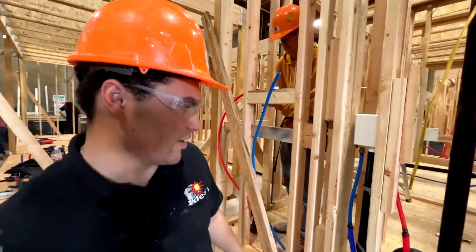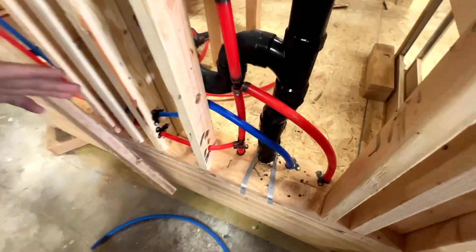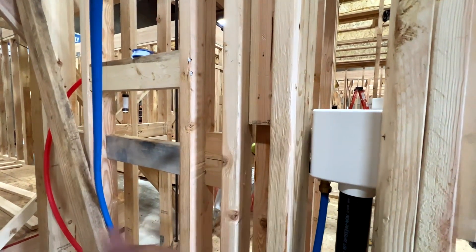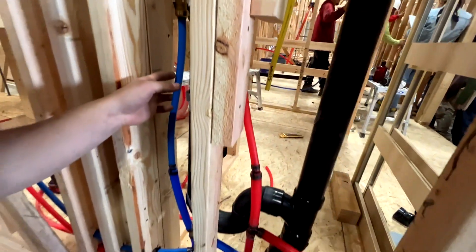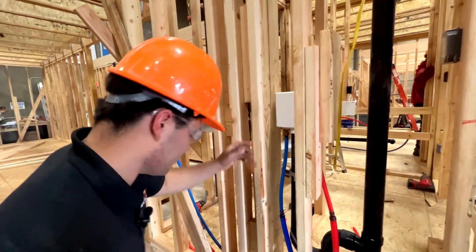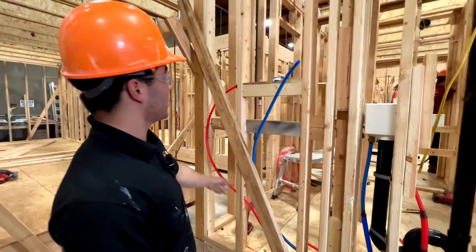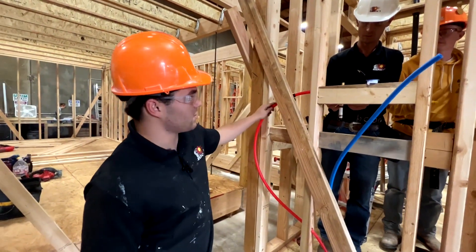Yesterday we started our plumbing for our washer, dryer, and shower. Our inlet comes up feeding both the sink and toilet and will tie into the washer, dryer, and shower. We have our ABS P-trap and vent through the roof to prevent vacuum suction. Feeding into the shower we have half-inch PEX, hot and cold. We're going to loop it around and connect it to the valve without using any 90s, because every 90 restricts our PSI.